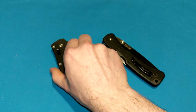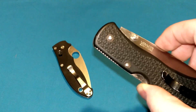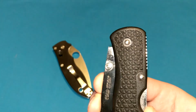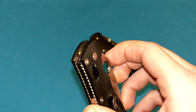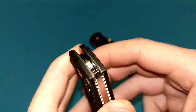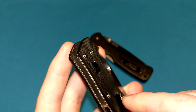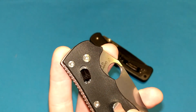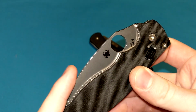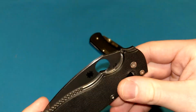Very interesting. So is there an advantage to pins? Actually, yes. The advantage is that they will never fall apart on you. They can't possibly unscrew. It's a single piece of metal, pretty much. Pins are not two pieces of metal put together like screws are. As you know, a screw has a female and a male side. The male side screws into the female side. You can get them tight. You can lock them in there. You can Loctite them in there. A couple different things you can do to keep them in place, but ultimately they are two pieces put together, and there's always that chance. Murphy's Law, there's always a chance something could go wrong, something can fall apart, something can loosen on you, etc.